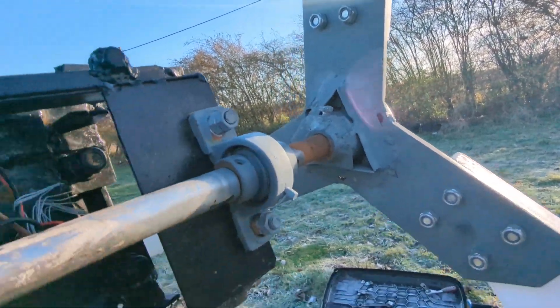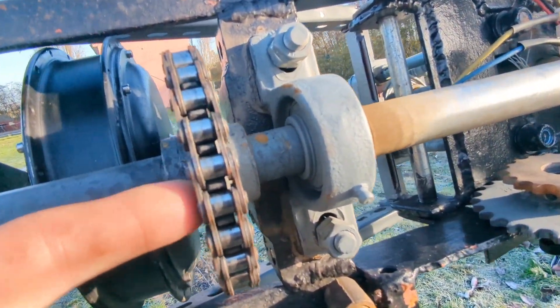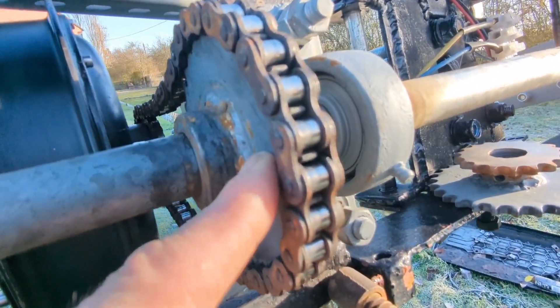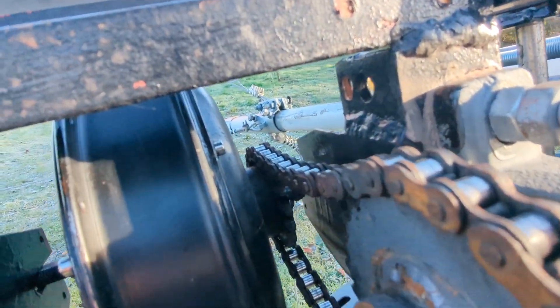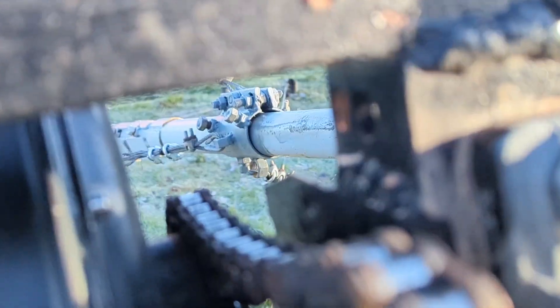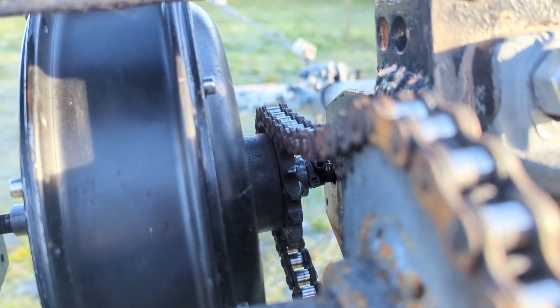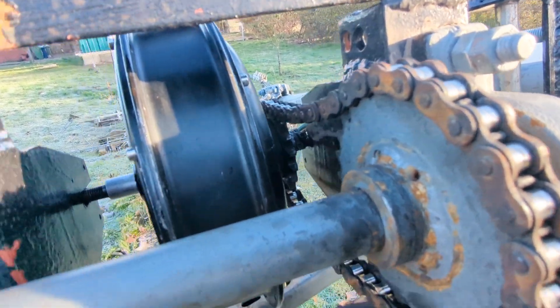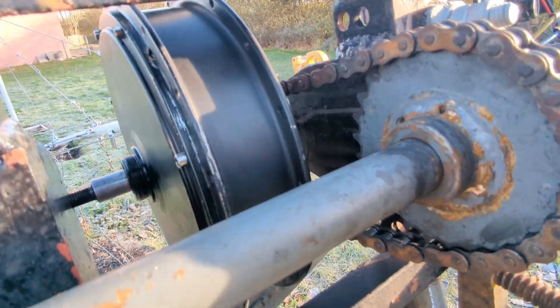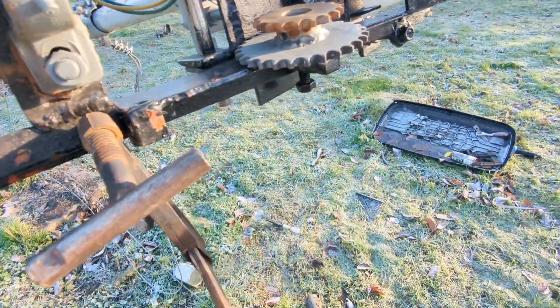At the moment, the wind hits the blades, travels down the driveshaft, and hits this gear which is 26-tooth. That transfers the power via the saggy chain to an 18-tooth gear on the sprocket of the electric bike motor hub — that's a 3 kilowatt unit, allegedly. It's pretty heavy, about 12 kilos.